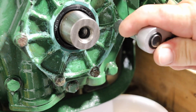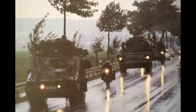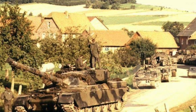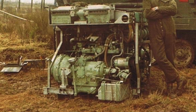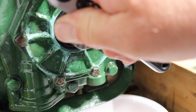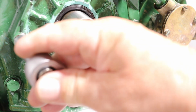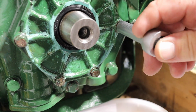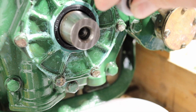When I served my time in the forces, in the height of the Cold War in the 80s, all the main armoured vehicles, fighting vehicles, had a method of being able to change their engine called a pack change. So there'd be a spare engine in a frame, pre-tested, oil cooler, everything ready to go. All you had to do was undo the drive couplings, the exhaust, and everything else was virtually plug in, and you could swap the engine over in the field using a hydraulic lift mounted on the back of another vehicle.